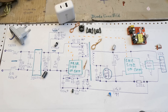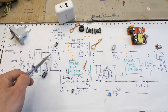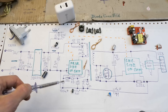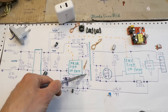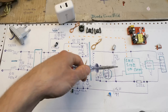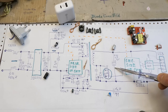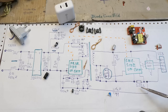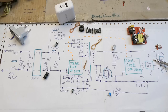And of course the schematic of it, at least a partial one. The mains comes in here through a fuse, interference suppression filter, a bridge rectifier, then the primary smoothing electrolytic capacitors, some further interference suppression, and here it splits into the two sections. Here's the full schematic of one primary side: the transformer primary, its snubber network, the auxiliary winding, and a rectifier to produce a low voltage for the chip. This is the primary side of the chip and the secondary side is here, internally coupled through optocouplers.